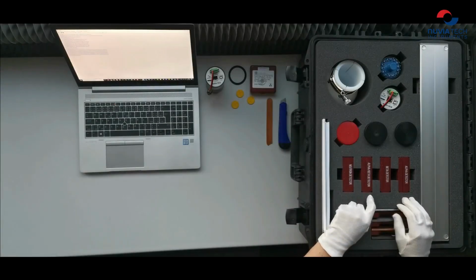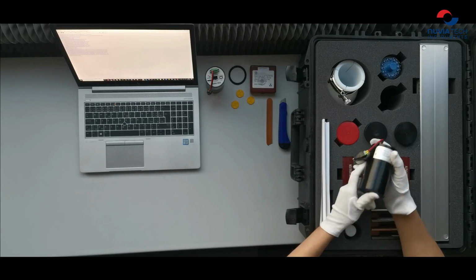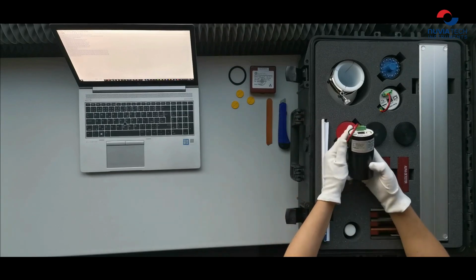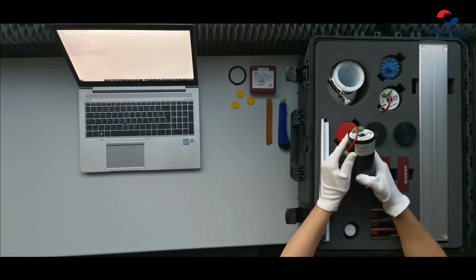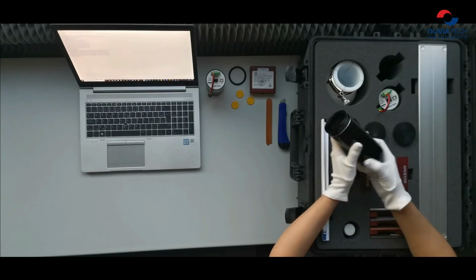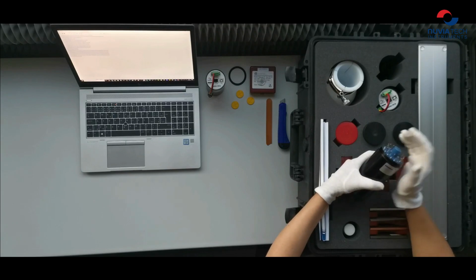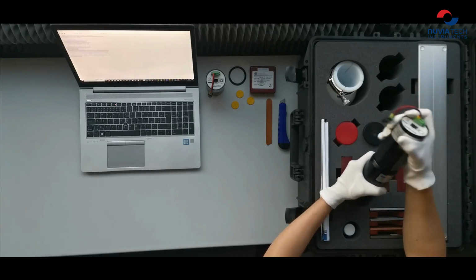All of these detectors are products of NUVIA, as well as these analyzers. Here is NUVIA MCB multi-channel analyzer for gamma spectroscopy measurement, and as the option here, there is also NUVIA SCA channel counter, which is used in counting applications where spectroscopy is not necessary. Photomultiplier is a very important part of the kit. It is universal, so all of these detectors can be connected to this photomultiplier, as well as both analyzers. The analyzer can be connected very easily in this way.